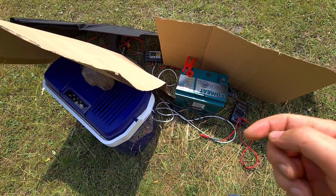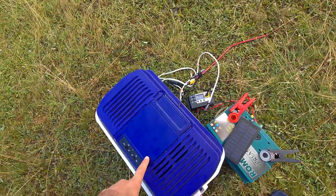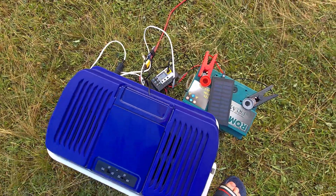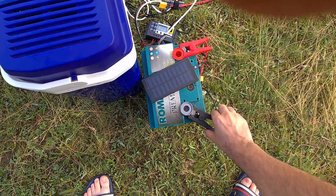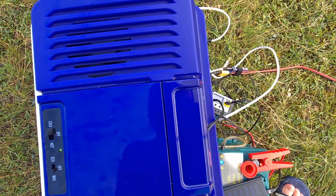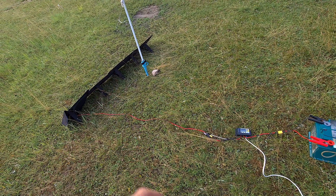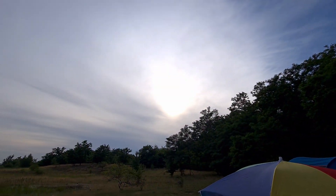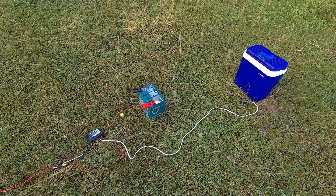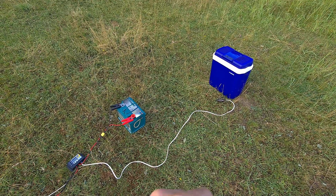Currently the battery is slowing down the fridge. There's not a lot of sunshine, and the fridge constantly stops. Simply disconnecting and reconnecting the fridge doesn't make it start again. Disconnecting and reconnecting the battery from the controller turns it off and back on, and the fridge starts again at 11.7 volts. Either the solar panel isn't powerful enough, or we don't have enough sunlight — sun is going down and it's hazy. The fridge has a built-in feature to turn off when battery voltage is too low.